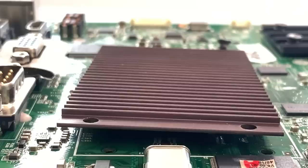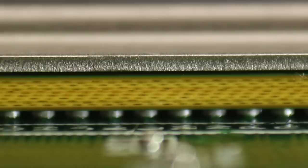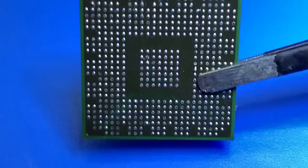After removing the plastic clips on the heat sink, I can get to the CPU. This type of chip is called a ball grid array, or a BGA chip. The solder connections are underneath the chip, and even looking up real close, it's extremely unlikely that I'm going to see which solder point is the culprit. Here's an example of another BGA chip similar to the one on the main board — chips like these could have hundreds of solder points.